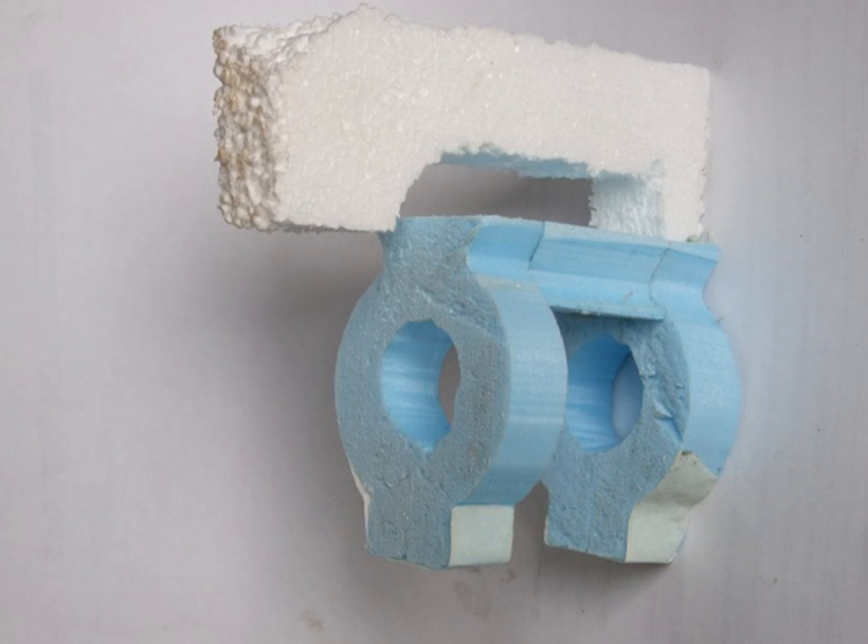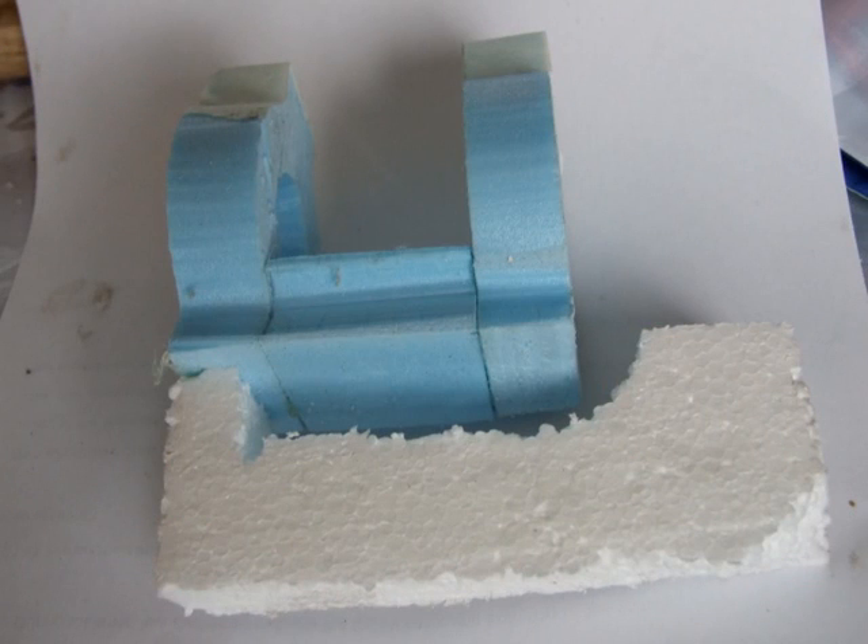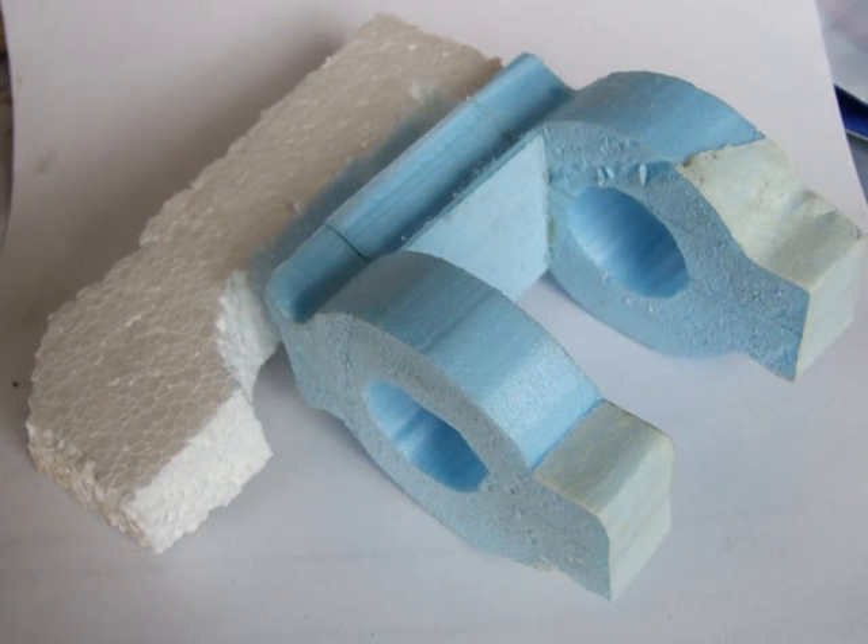The white foam sprue was hot glued to the assembly so as to feed the molten aluminium to the bottom of the pan. The hot wire cutter was run into the centre to remove a disc of foam from each motor mounting flange. The entry cut was covered with masking tape.